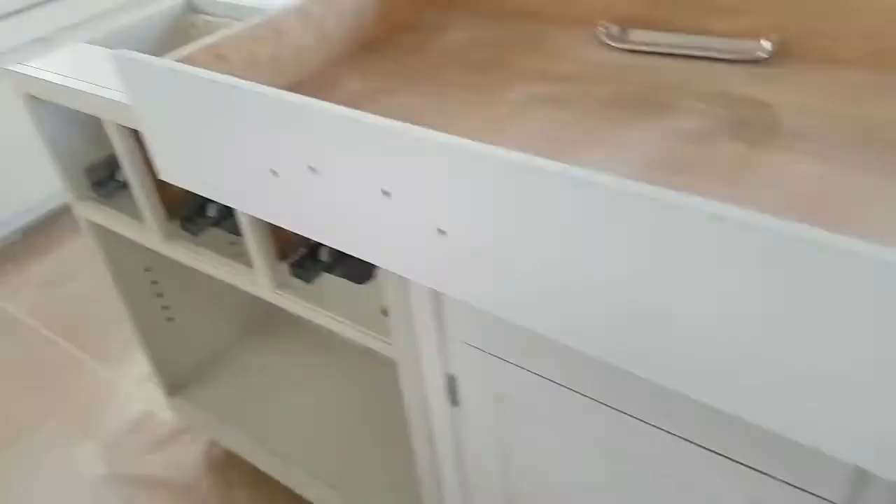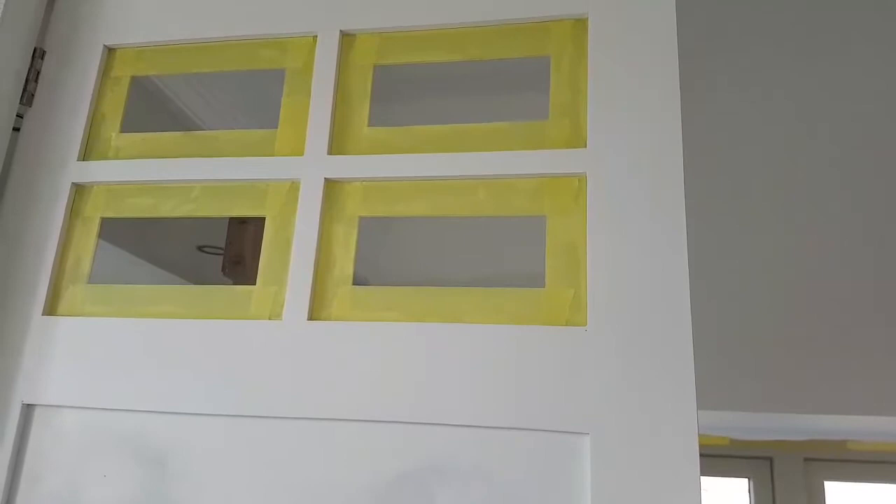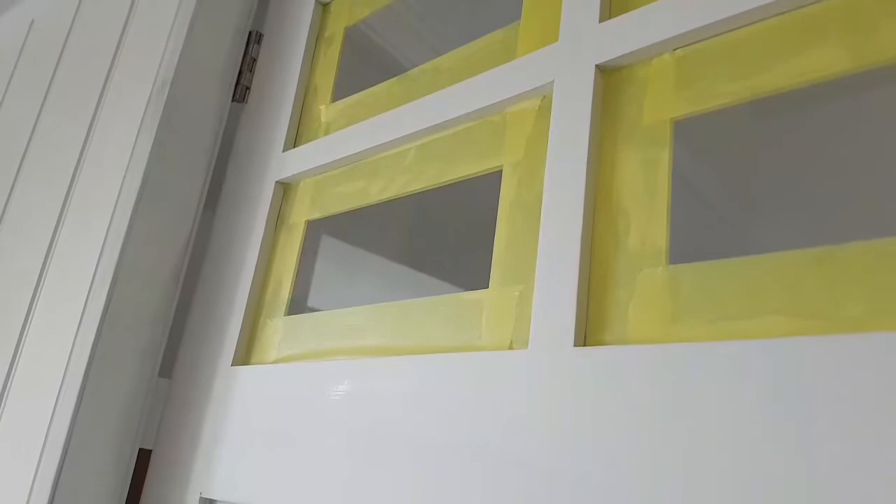This kitchen has got to take a bit of time. The windows I've had to mask up - it's getting three coats - so it just made sense to mask it up and paint it that way. Especially if you have a look at that bead, it's tiny, so to cut that in without getting any paint on the glass would just take me ages. It just seems a lot easier.